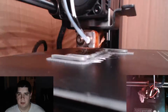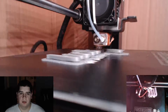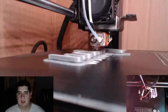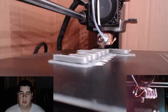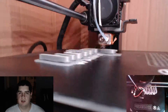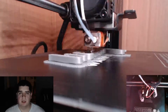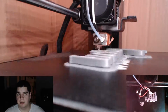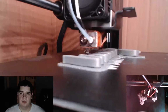The filament I use is Inland brand ABS at 230 degrees C on the extruder and 100 degrees C on the bed for better adhesion. I found that removing the cooling fan for the extrusion on the printer actually helped to do better quality ABS prints, helped to even out the cooling of the ABS as the layers are all laid down, to help reduce warping. Another thing I did was take the box the printer shipped to me in, turn it upside down and stick it on top of the printer to help trap some of the heat inside from the heated build platform and the hot end.